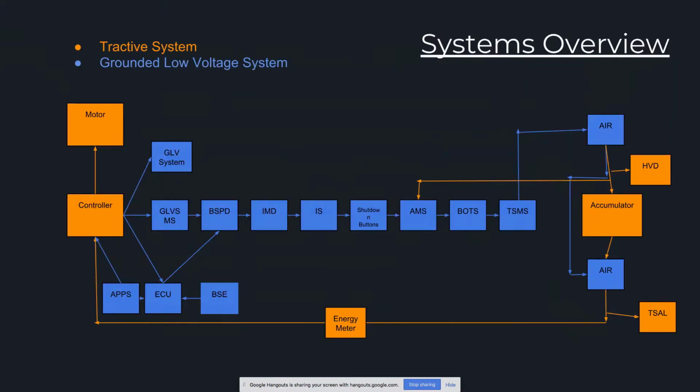I've been doing research over lithium-ion battery accumulator systems, and I know what they need to be doing. I'm not sure to what extent, but I assume that we'll purchase the system. This is a fairly common need as far as using these large lithium-ion segments, making sure that the load balancing is being done, that we have the right temperature sensors and that the system is being shut off, and that all the feedbacks are correct as far as the isolation relays, that those are getting actuated appropriately when the system is unstable.